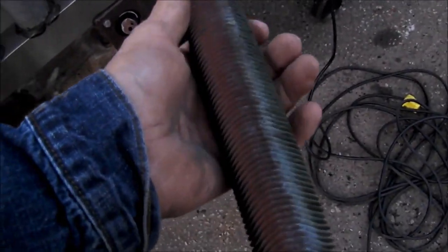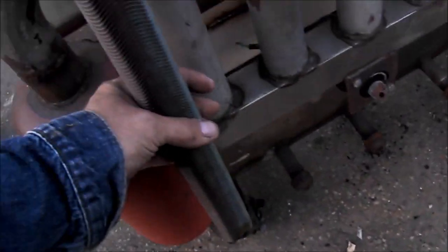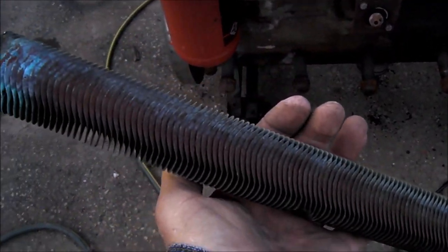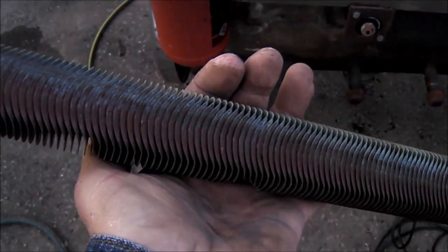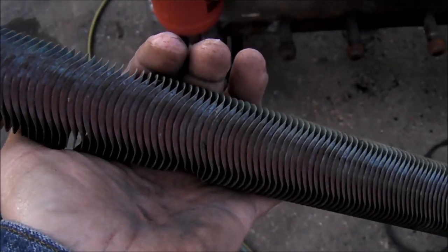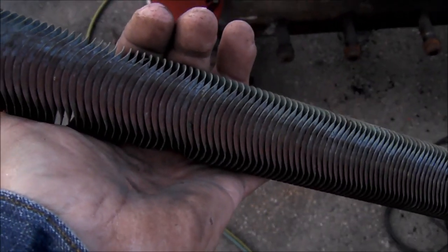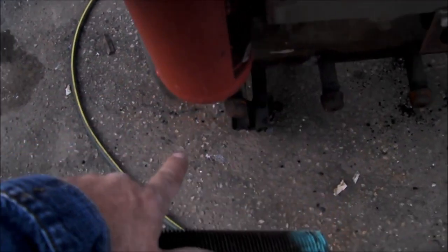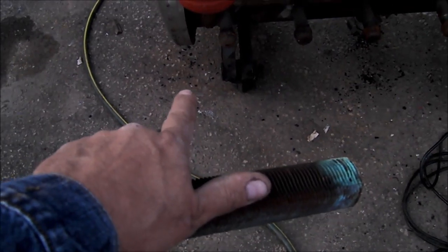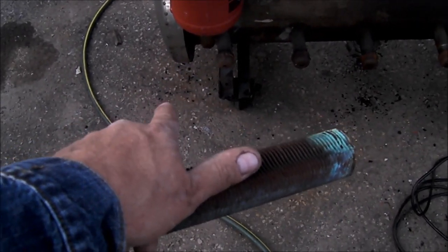It's really heavy — each one weighs about three pounds and there are 24 of them. I like to put a battery-operated 12-volt car fan motor to blow over them and dump the heat off. When you take the heat off the smoke it becomes more dense and condenses because it's cooler. In the cyclonic filter there will be a jar bolted to the bottom of that nipple, and that moisture and any material will drop off into that canister so you can take it off and dump it out.